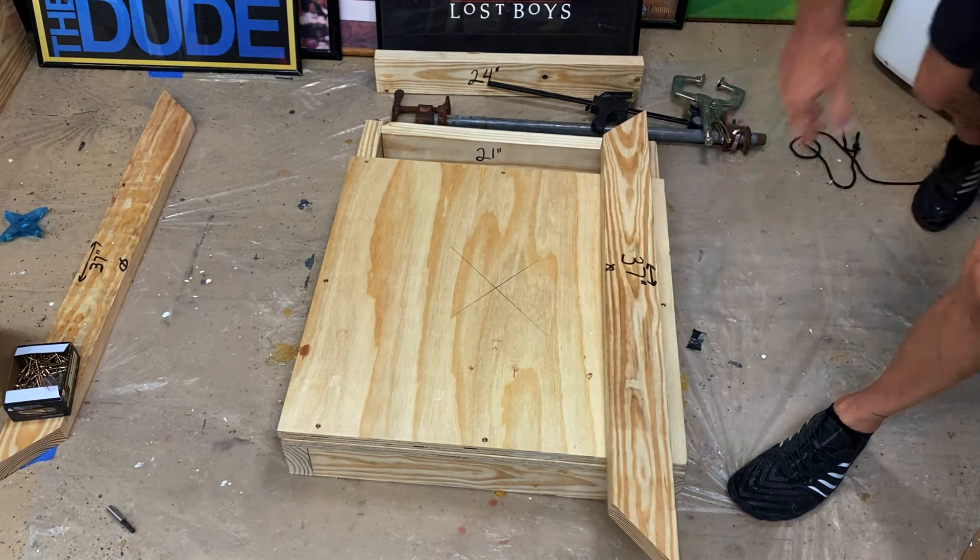There's your moment of silence so you can get your screenshot. I figured there were people out there like me that if they were watching somebody's video making this, they'd be thinking, do you have any drawings of this? So yes, I did make drawings. It's very self-explanatory - this is your 2x4 frame, your 2x4 support, your plywood drumming surface and the measurements, your angles, the measurements for each angle. And then your top view - I'll give you another moment to look at it.